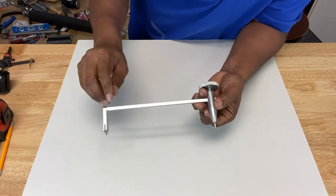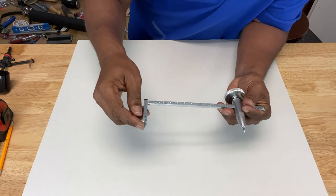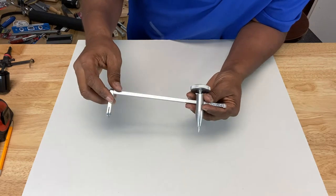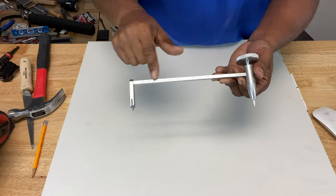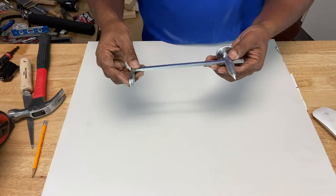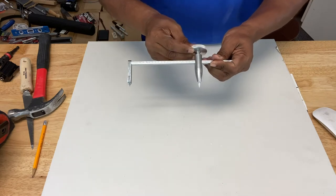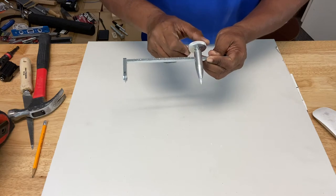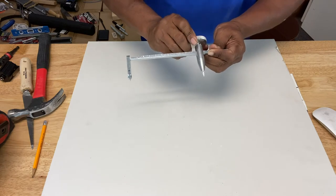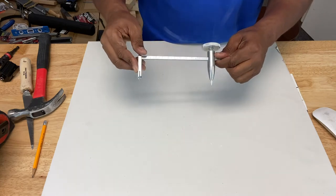The spanner has increments on it, and these increments allow you to measure the diameter of your circle. On this end is a very thin blade that you would use to mark the circumference of your circle. The maximum length of this spanner or metal ruler is 16 inches. So if we want a circle of about 21 inches in diameter, we'd bring this portion down to about 10 and a half inches, which gives us a radius of 10 and a half inches — and that's how we set our measurement for the radius and ultimately the diameter of the circle.